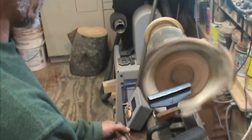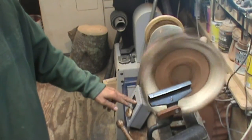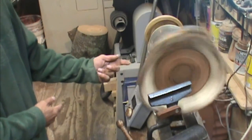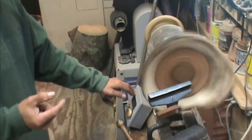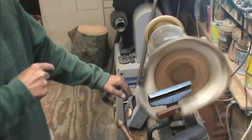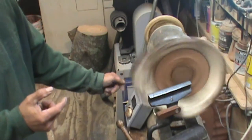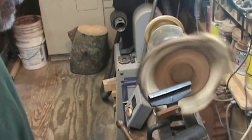On that potentiometer, I also picked up a digital gauge for reading my RPMs. They sent me the digital readout but no pickup, so I had to go online and order a separate pickup. I thought the price was a little cheap and the picture only showed the readout — it did not show the pickup. You can't use it without the pickup. So I ordered a pickup and I'll put a magnetic pickup coming from in here, going down into the box and wired up. I'll have my actual RPMs displayed right on the unit.